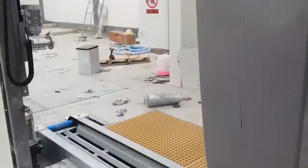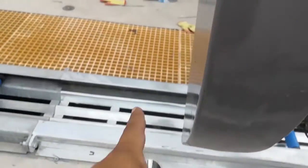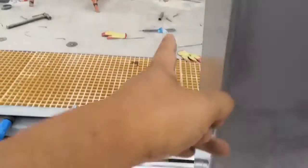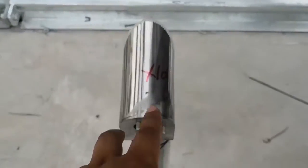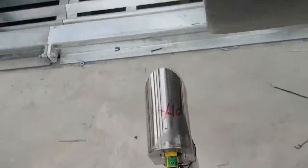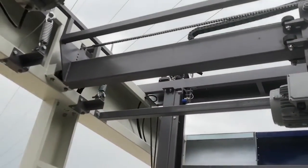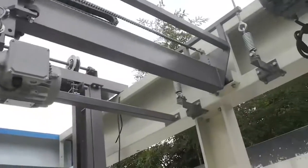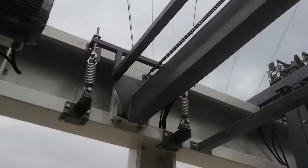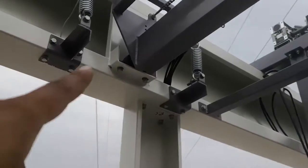After the dryer is a side dryer. Right after the side dryer, here, you need to put another sensor. This is for the 14 brush machine. Only the 14 brush machine has this sensor. The signal is X10. Okay. After this is a side dry brush. Alright. So the side brush safety is X65. Here is a safety sensor. Okay.